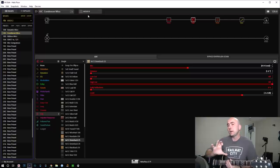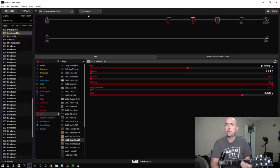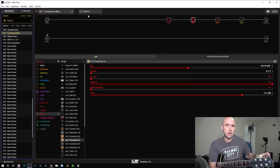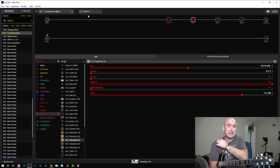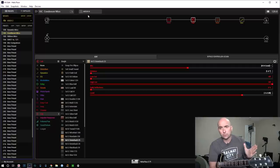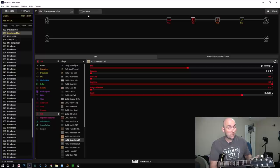As we saw in our frequency response charts at the beginning of the video, we noticed that compared to, let's say, an SM57, the low end is going to be extended out a little bit more. It's going to be an overall flatter frequency response. The high end is probably going to be extended out with less of a roll off as well. So let's see how that sounds, okay? We may get a little bit more of a darker sound because of the extended low end, until we decide to roll that off. We may also find a nicer, smoother high end to these where it doesn't have that graininess of a dynamic mic. So we could have a nicer, smoother, fatter tone. If we roll some lows off, we might have a nice, smooth high end. Maybe almost between a ribbon and a dynamic in a sense, best of both worlds maybe. Anyways, let's try it out.